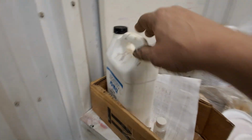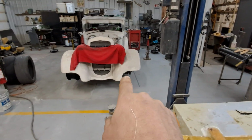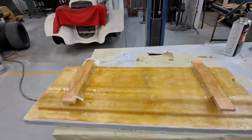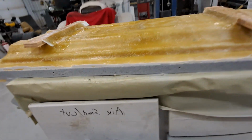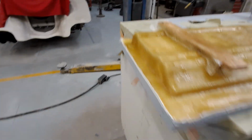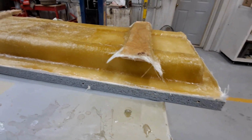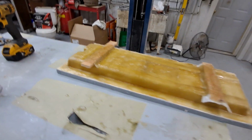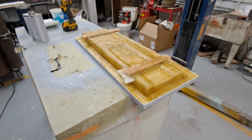I'll lay in the gel coat first. Probably just enough to give it a nice peel. It'll brush on. I'm gonna put it on a little lighter than I did this. I put this on pretty heavy, and I don't know why. It's hard to see. You're supposed to build it to a mil, I suppose. Actually, technically, I have a mil. It's rolled up the edge, but you can't really tell looking at this. This is probably a pretty good representation right here. Anyway, so now I'll set him aside and get the other one over and start on the hour-and-a-half journey.